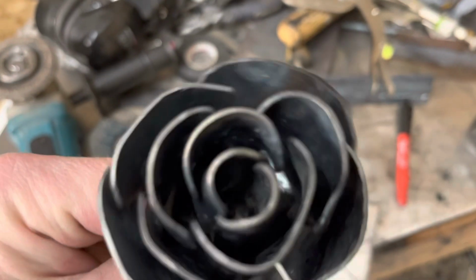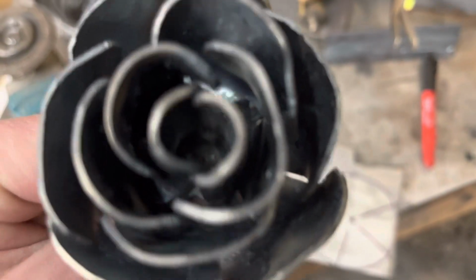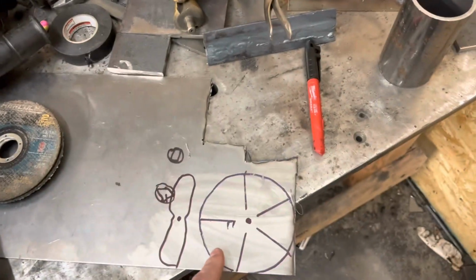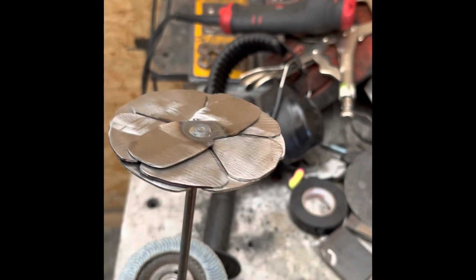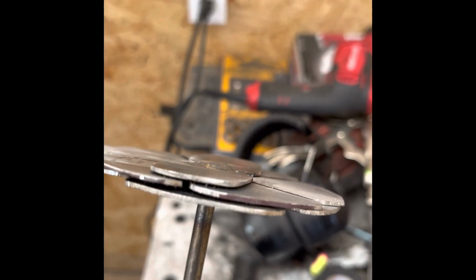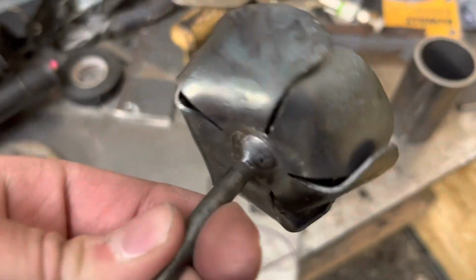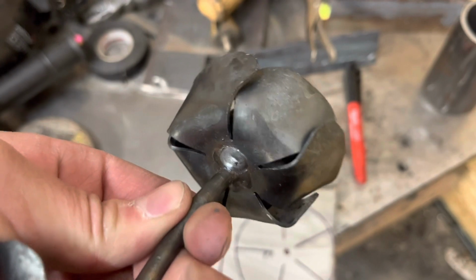And you tack the top one. You can kind of see the tack down in there. And then sandwich everything together and offset these 2 for the middle and the bottom one. So just stagger them. And then you can weld around the bottom one, and it makes everything go together and kind of sandwiches it all down.